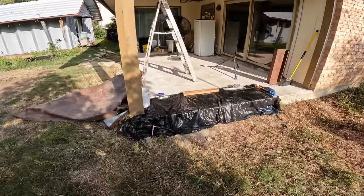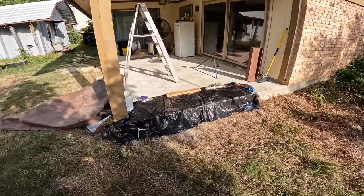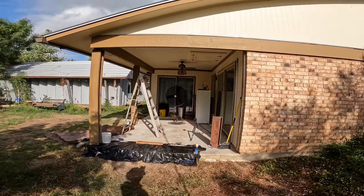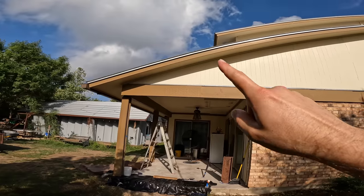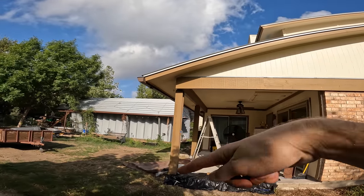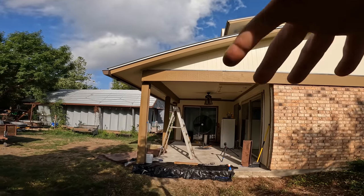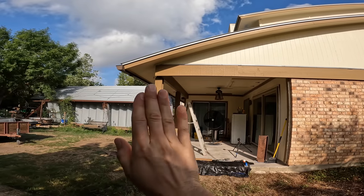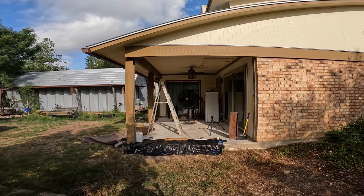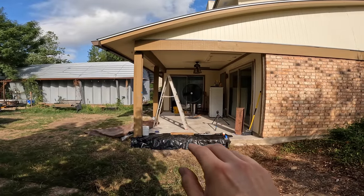The concrete is now poured and it's been drying for about two and a half days. I've been spraying it with a water bottle several times a day while it's curing slowly but surely. Root cause number one was exposed rebar tips. Root cause number two is that as the slope of my roof goes up, the awning becomes less effective - driving rain can reach the slab more easily as the roof gets further away from the concrete. My plan is to put a big glass wall over this whole thing, but awnings are nice - you want to step outside without getting poured on. And I don't want water pooling up on whatever joint is between the glass wall and the floor. So I'm going to make an awning.